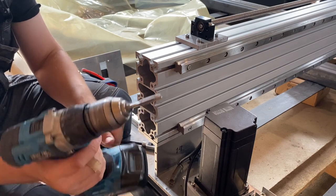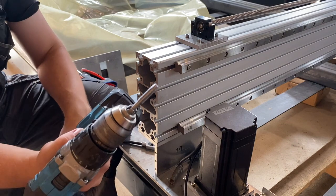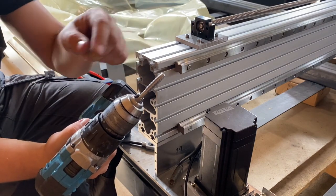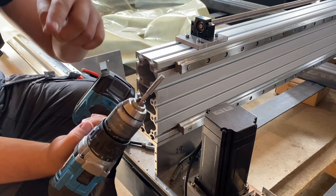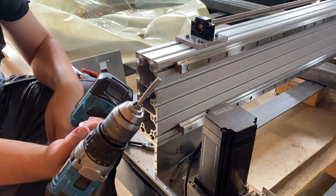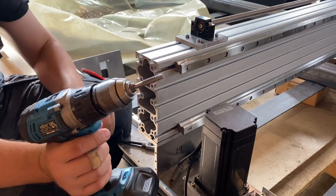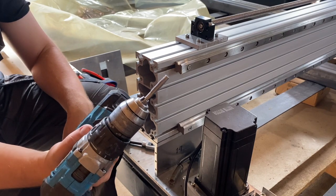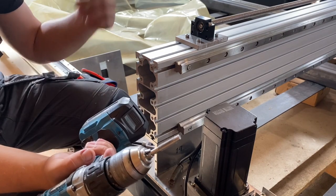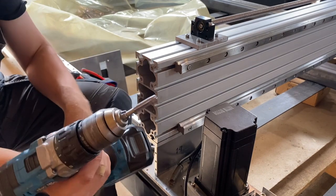And the big difference here is that this has just these grooves, and the professional tool has a spiral cutting blade, and there's kind of one continuous chip coming off the blade, but this one makes dust and debris that goes in there and it gets stuck immediately. So, well, I'm just doing a few holes here, but if I were doing dozens, I would really invest in a proper tapping tool.